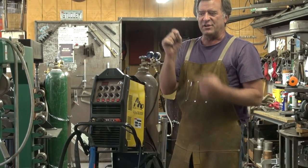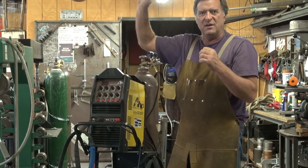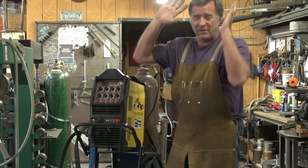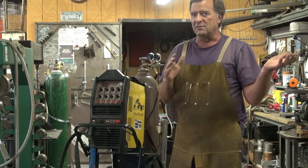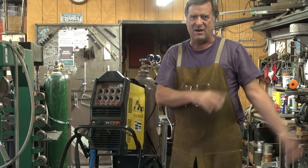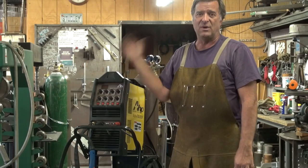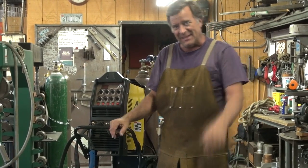Look at what you're going to do with the machine. Are you going to be just welding on the bench playing around like I do? Are you going to be building race cars? Are you in a production facility where that machine is going to run all day long? They're all going to need a different duty cycle. If you're going to make a living with the machine and weld six, eight, ten hours a day, you want the highest duty cycle you can get so the machine doesn't leave you sitting while it's trying to cool off. I hope that answers your question. See you later.